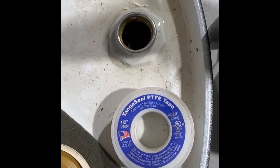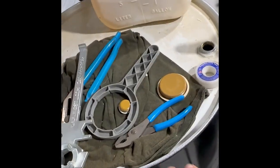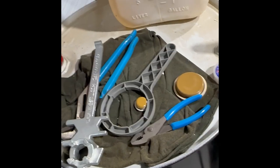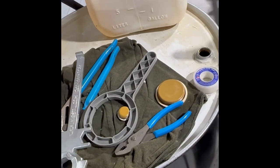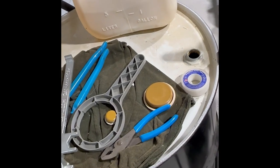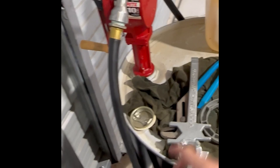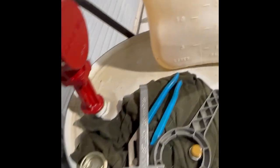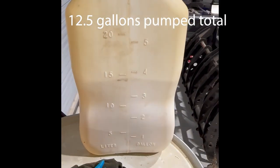You can see the level right now is somewhere around a half inch to three quarters from the top. I always like to leave an air gap in tanks like this because when it heats up it expands, and the expansion is a big deal because it'll actually force itself out of the pump and go all over the top - as you can see by the dirt stuck to it. Right now we are at a little over three and a half gallons.